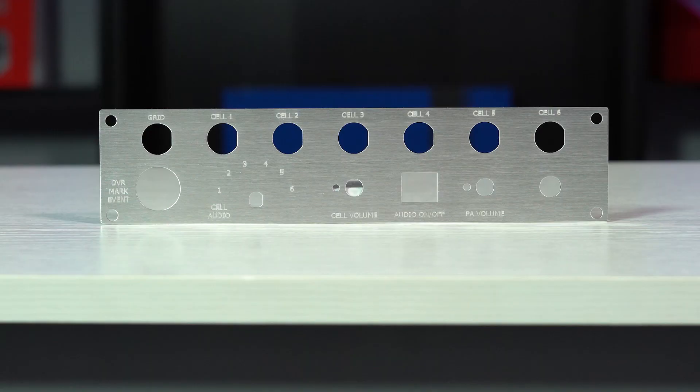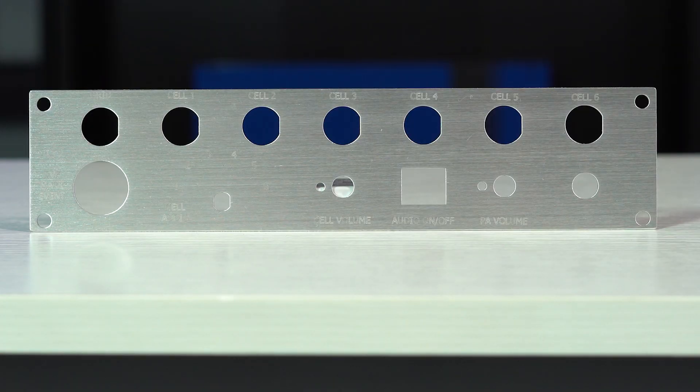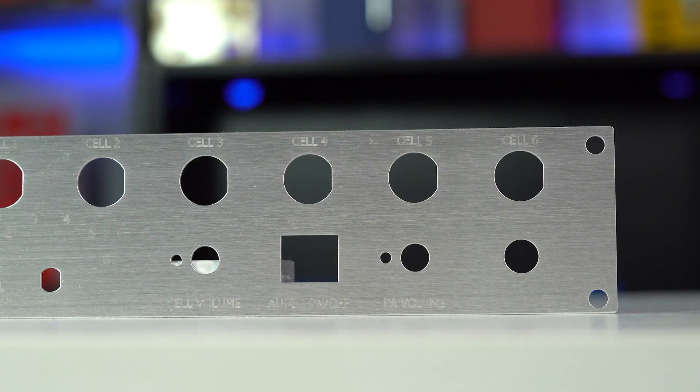Next up is the silver mark. This mark is created by frosting the surface of the metal at high speeds. The result is typically a white colored or bright colored mark. The laser marking type of outline is a simple line etch of the profile. This type of mark is not meant to be deep — you can think of it as scratching the surface.